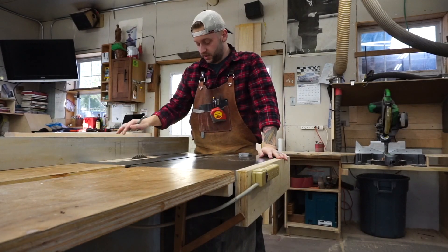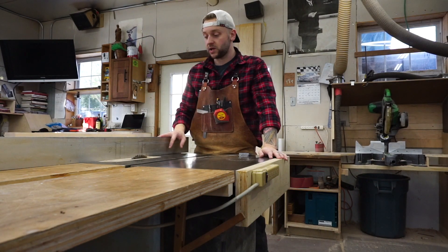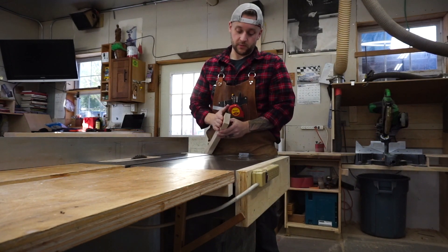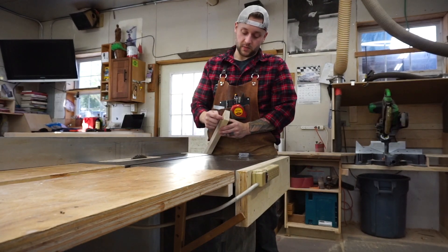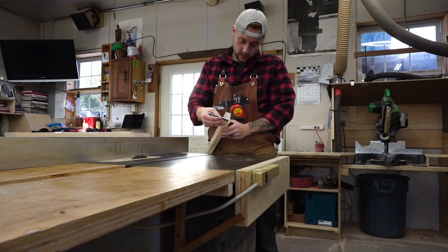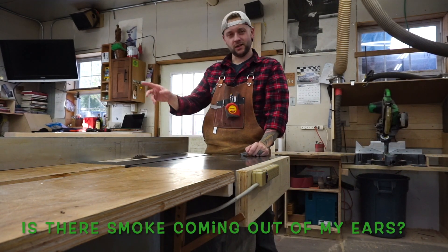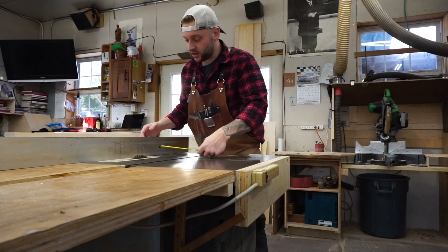What we have here in the saw is a quarter-inch dado stack. Now typically we're working with half-inch panels so we would do this with a three-eighths inch dado stack, but this is a shop project so three-eighths inch plywood is fine, so a quarter-inch dado is what we're going to use. Now typically you would take this dimension from this side of the board to the dado and set your fence, but a trick I recently learned is to actually do it the other way around — take the dimension from this side of the board to the far side of the dado, which is 22/32nds, or 11/16ths, and we're going to set our fence to this side of the blade at 11/16ths.